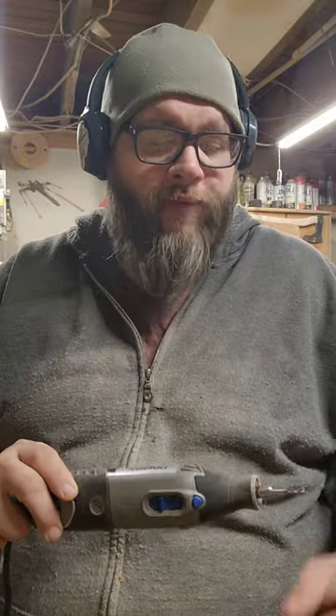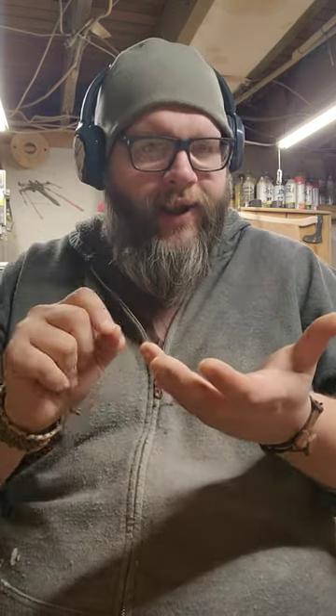So if I'm not doing something hyper-specific, or I'm not in a crunch time like I am now, generally speaking I do a hybrid when I'm carving. I will use the hand tools to kind of shape and get the look I want — it may even get the majority of it done — and then come in and finish up with the Dremel. I have some really nice sanding tips for my Dremel, and it's really nice to get in there and clean up ragged edges or get nice smooth inside surfaces in the negative space of a carving.